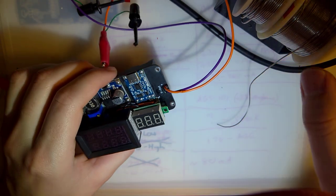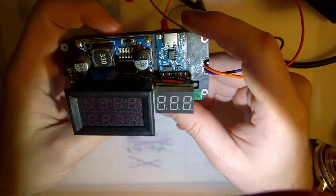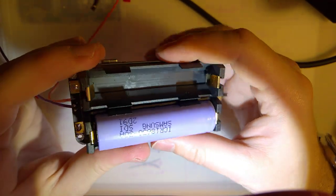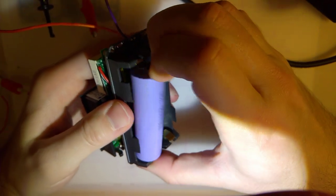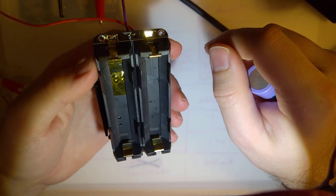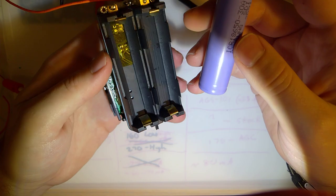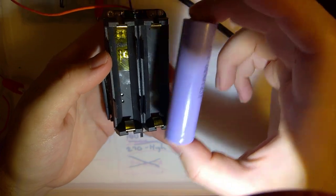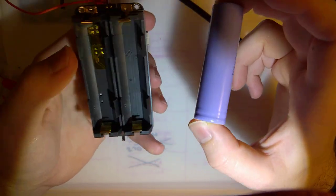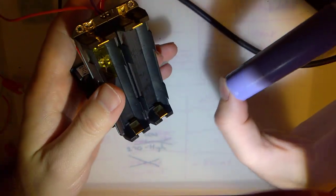All right, I thought I was done for the evening, but I just want to add one more quick thing while I'm still thinking about it. I would normally just type this sort of thing out in the description, but I feel like it needs to go in the video. If you do use two batteries, you need to be extremely careful, because these are just wired straight in parallel. There is no protection between them, nothing. If you use two batteries, you need to make sure that when you insert them, they're both at the same charge level, or one will discharge into the other, and that could be bad. Probably won't if they're very close, but just don't do it.